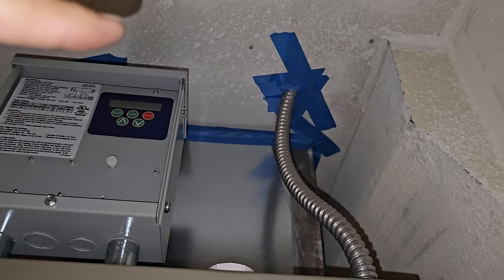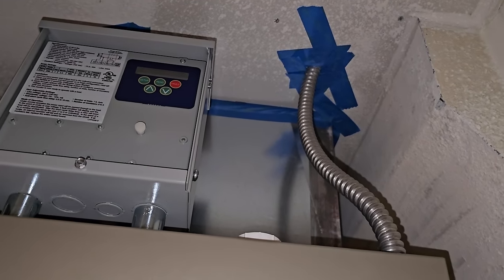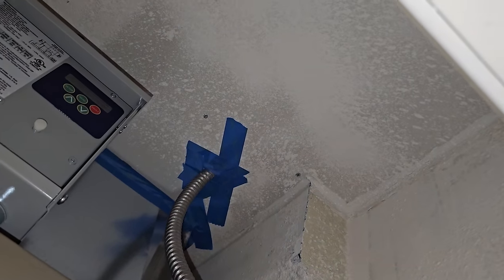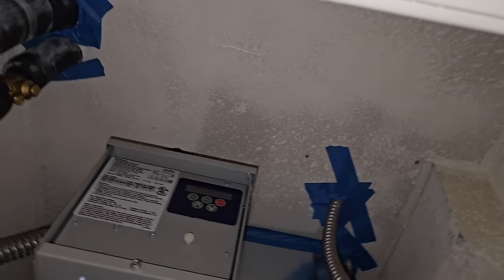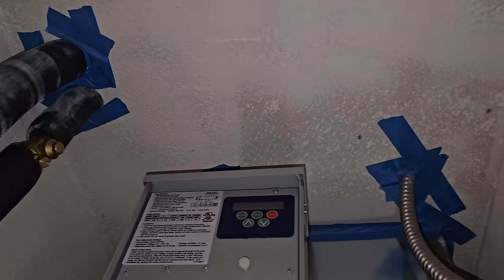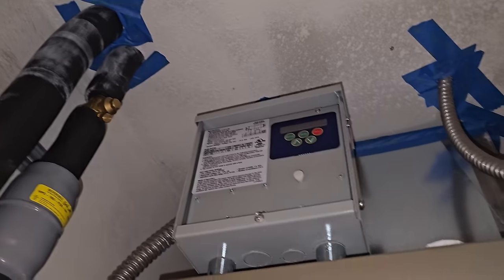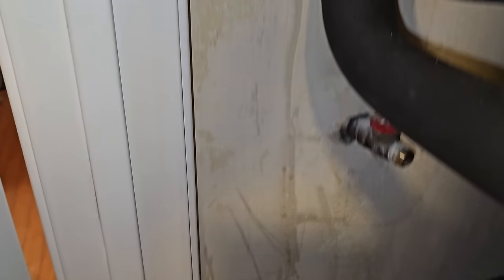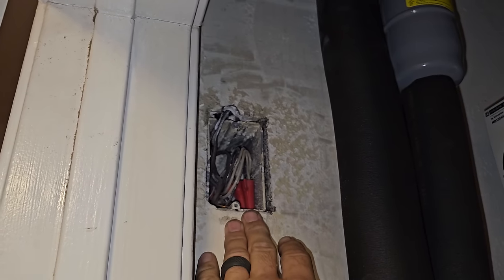I got in the attic today and spray foamed all around the plenum to air seal basically this cabinet, because this cabinet's completely air sealed now since I cut out the combustion air vent, the fresh air vent and everything in here. We sealed all that off, put new drywall up. So this is a completely airtight cabinet. Still gonna replace that receptacle because it was getting really difficult to pull the furnace plug out. We still have that to use if we need to. This was my old doorbell. I'm gonna figure out something with that.